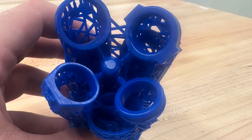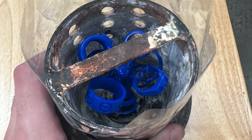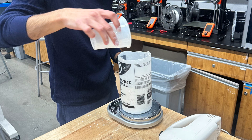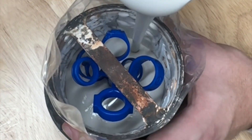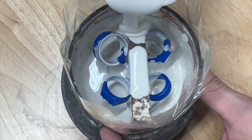That's what this looks like. I then removed the supports and attached it to the sprue base. I put it in the flask and, again, mixed the plaster. My friend actually helped me weigh it out and mix it, which was nice. After we mixed it, we poured it in and then put it in the vacuum chamber, which I didn't film, but we went through the normal steps.